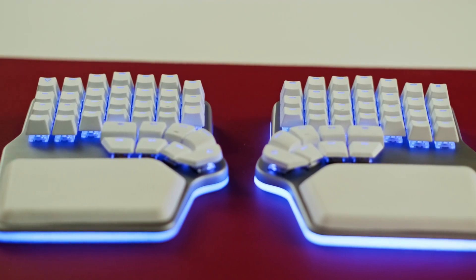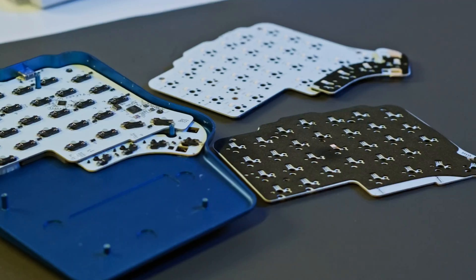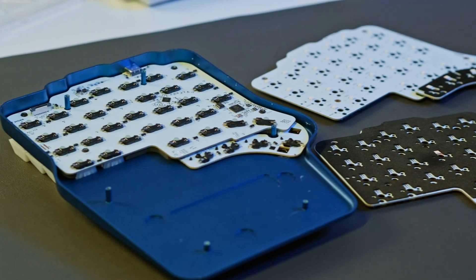All these ideas use standard RGBW LEDs controlled by an LED driver that determines the intensity of each tone — red, green, blue, and white. If you have an LED strip with only one driver, all the LEDs in the strip will display the same color. If you want each LED to have a different color, you need to address each one individually, requiring a bigger chip and more space and connections. And as you've seen, we don't have a lot of wiggle room in the keyboard.